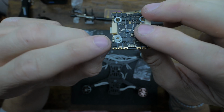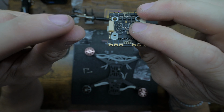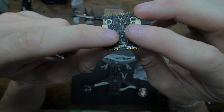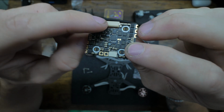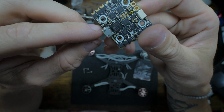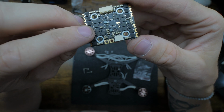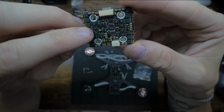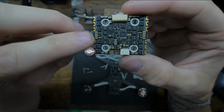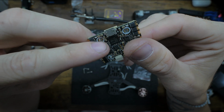Also, you don't want to torque them down too much because they're plastic, so as you tighten them down, they will start to squeeze and get wider, and they'll push off the caps as well. So be very careful with that if you use these. These are very strong, but they're very small solders, and especially if you don't use the clips, like I used to use all the pads in here, it's pretty tedious. So make sure you know what you're doing, and definitely use enough heat and be quick and out. Get a smaller tip if you need to. But let's get this on there.